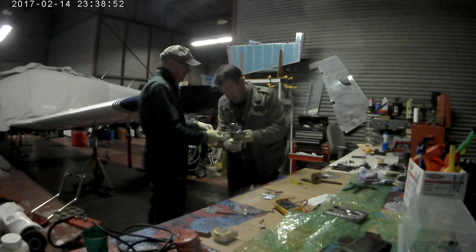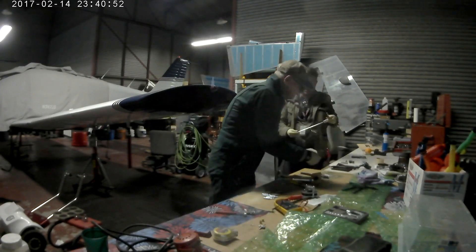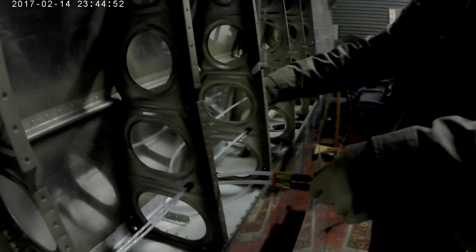Once those two pieces of hardware are inserted over your tubes, you can go ahead and flare. The flaring tool that my mechanic lent me is awesome. We did both, so now we're here and test fitting. My buddy Ted was holding onto the pitot tube and I was blowing into the reciprocal plastic lines, which you can see me having run through the left wing. And there you can see the adapters, along with the quarter-inch tubing. Pretty nice.